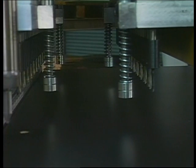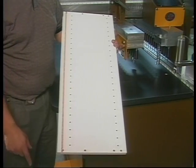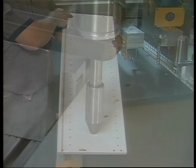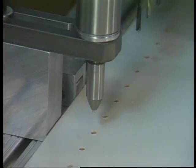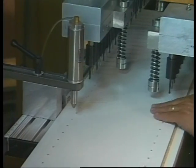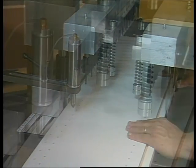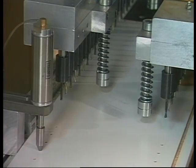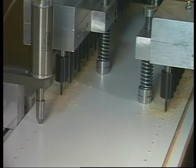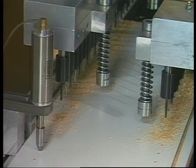All Ritter machine heads contain an odd number of drill spindles, so balancing of panels through centered indexing can always be achieved. In Ritter's single-point referencing system, the indexing pin is an integral part of the fence. The fence-mounted indexing pin maintains registration solely to the fence, and is the surest way to deal effectively with the normal inconsistencies of panel processing.